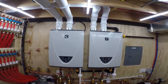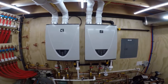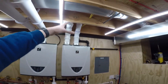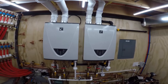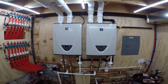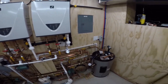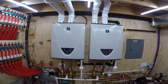What I'm experiencing is a low-pitched drone from these things as they modulate — as they go down to the next cycle, the fan speed changes. It's all on wood, on a wood wall, spray-foamed to the foundation, but it's all tied in and you're just hearing this vibration, this low-pitch noise throughout the house. It's not that bad — it doesn't wake you up or anything, but if you're paying attention you can hear it. I thought I'd turn the camera on and see if that dip switch adjustment made any difference.